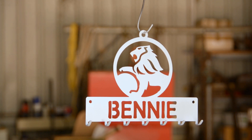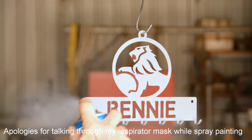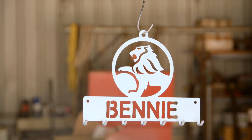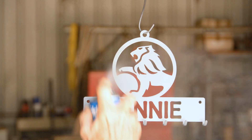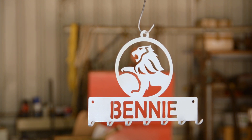Sorry for the muffled sound — I've got a mask on. I always wear a mask when using rattle cans or any spray paint. I'm just going to give it a coat of grey undercoat, then I'll give that 15 to 20 minutes to dry. If it needs another coat I'll give it one, and then we'll paint it with two or three coats of the black gloss they requested. When it's painted I'll get back to you and show how it looks.